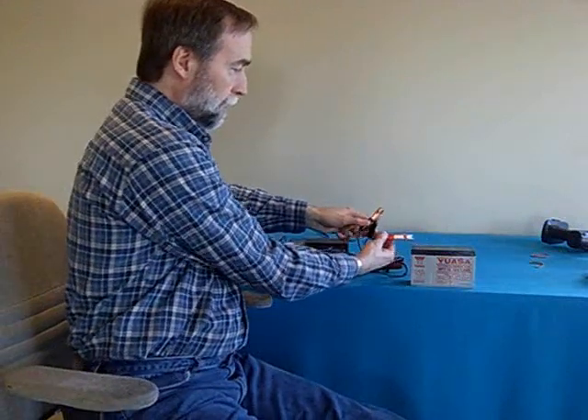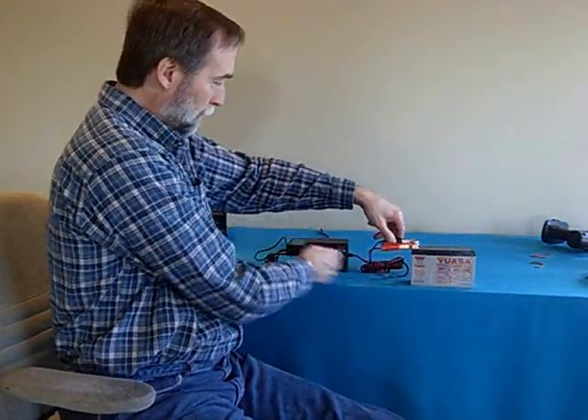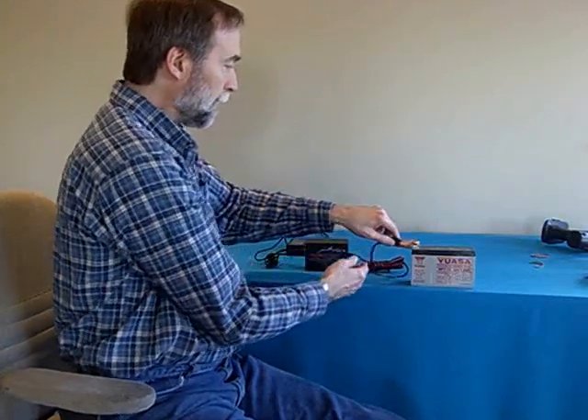There are no extra switches or buttons. The charger knows exactly what's attached, what it's attached to, and when it is safe to turn on. I can disconnect it and connect it up wrong again — and you get one little flash. It knows that's not the right way. And as soon as I hook it up right, it comes in with a steady state and starts charging.